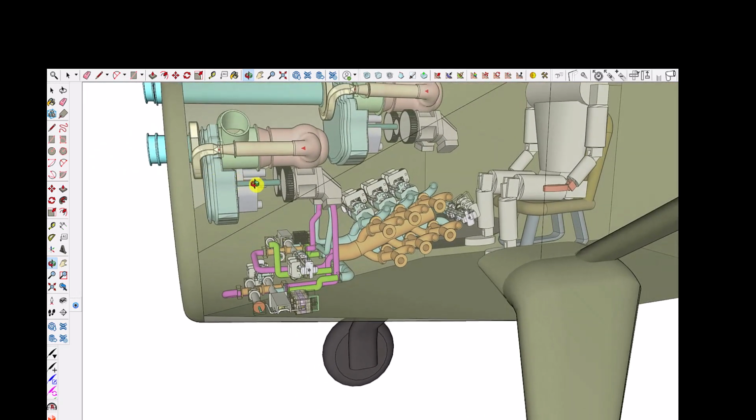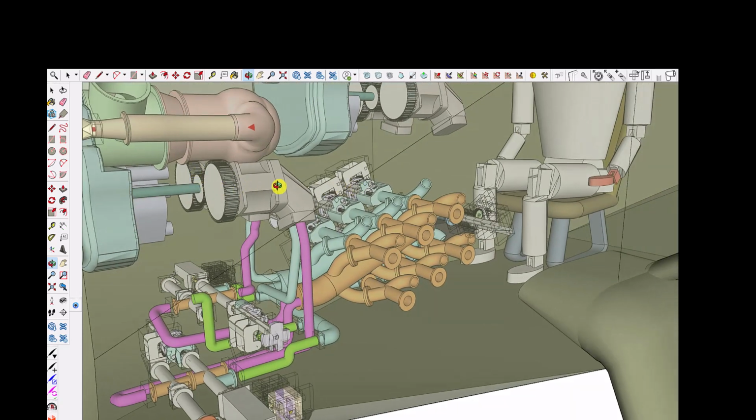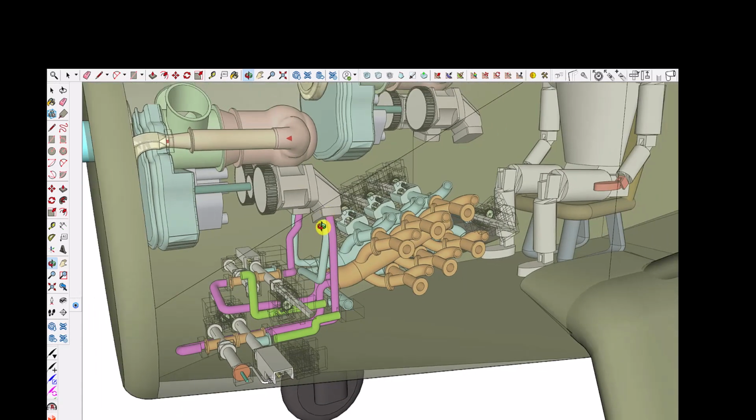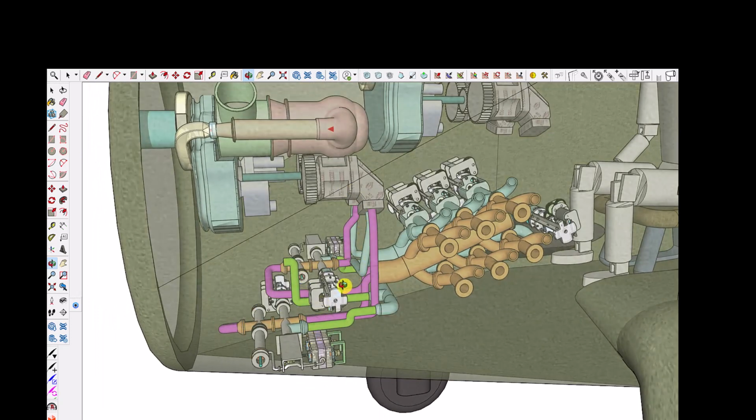and the turboshaft output of it is brought out and is turning these two pumps, and the output of these two pumps goes to this manifold system that controls the flow to the 6 propellers, so that you can individually adjust the flow to the propellers so that you have a stable hover.